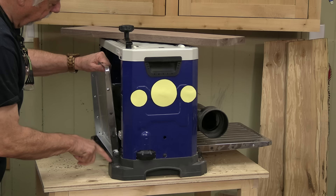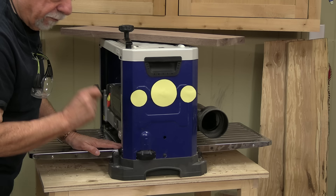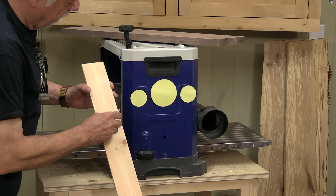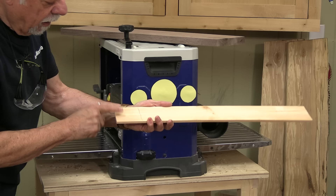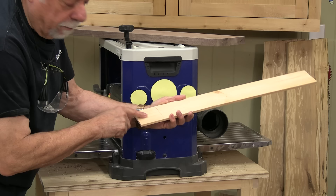This one has a very good adjustment and when I got it I fiddled around with it a little bit to get it exactly perfect, and this planer does not do any snipe. For those of you who have heard the word snipe but don't know exactly what it is — when you run wood through some planers, things can go a little bit askew and there's an actual mark or a little cutaway in the wood. Usually it happens at the end of a board — the cutter head sort of goes down a little bit and cuts a tiny bit deeper at the very back of the board. That's called snipe, and it's usually the thickness of maybe one or two sheets of paper, so it's not huge, but for a lot of people that can be a problem.